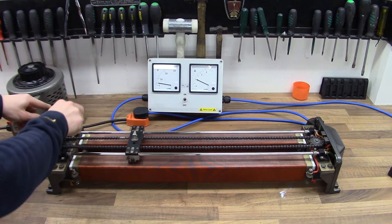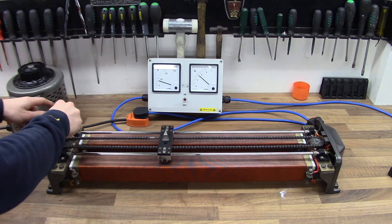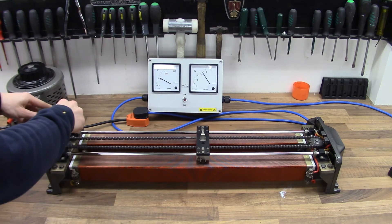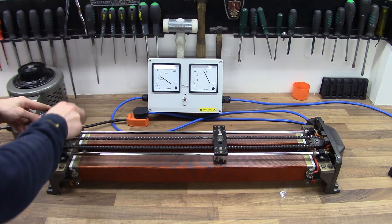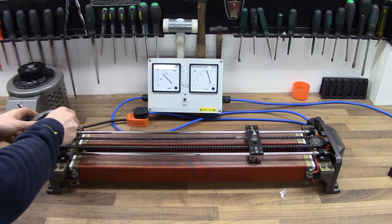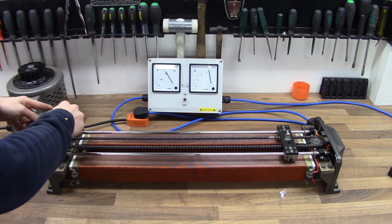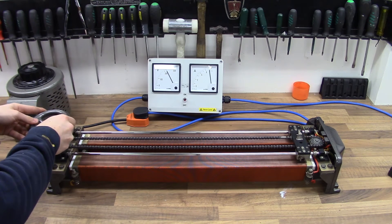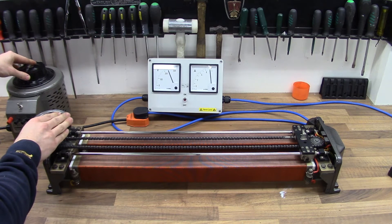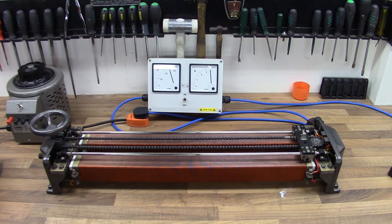It's drawing 2 amps already. Voltage is going up slowly — past 3.5 amps, 4 amps at 100 volts, 5 amps, 150 volts, 6 amps. Coming up to 200 volts, about 8 amps. Approaching mains voltage, which is about 225-230 volts at the moment. I'll increase that to 250 volts input. So at 250 volts input through this Variac at 100%, that's running about 9 amps on the heater.